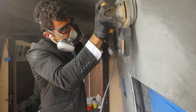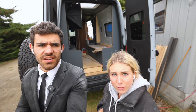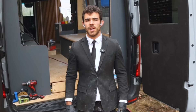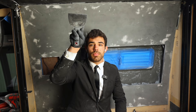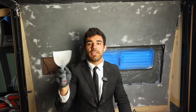I'm very dusty — my lens is dusty. For the second coat I'm going to be using a four-and-a-half-inch knife instead of a six-inch knife. I found that this worked a lot better on these walls because there is a curve all the way down, so I can't pull the knife sideways or the corners are going to create streaks. So the smaller the knife in this case seems to be the better.